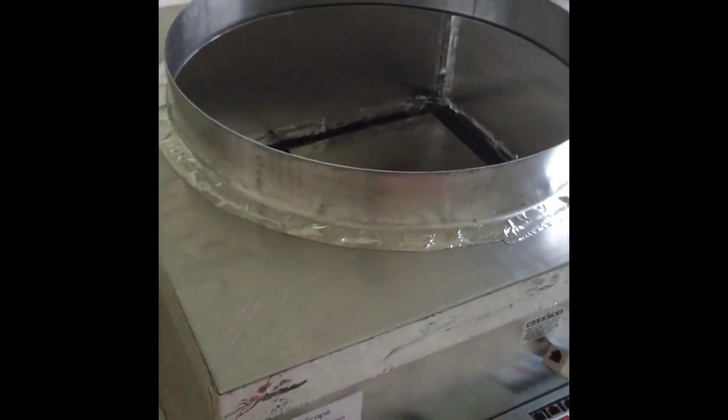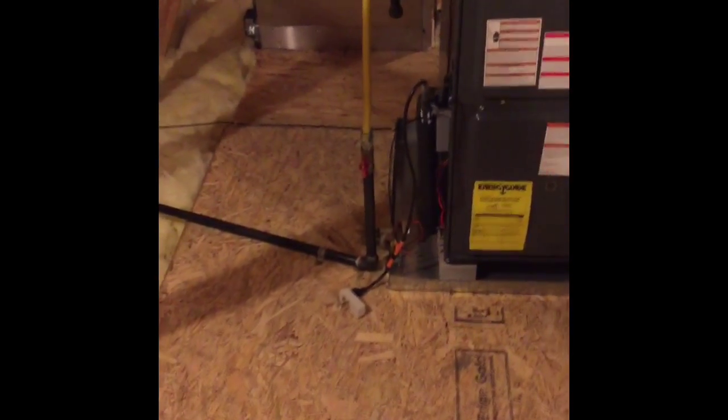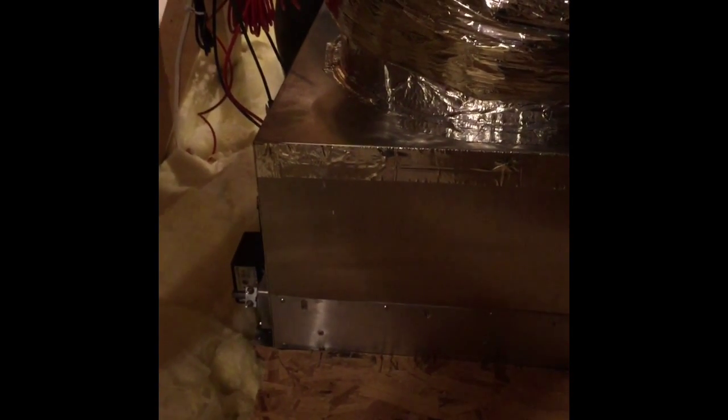Either way, the plenum box is built and it's time to cut a hole in the ceiling and find a place for it. I just finished the installation. How long it takes really depends on what you're installing into. I have a truss roof so my space was limited, and I also had a floor right over the center where I was going to install it, so I had to cut up a floorboard. Everything worked out well. The fan sits right on the joist of the truss. One thing to note: the trusses are made of 2x4s but the fan is supposed to sit on a 2x8, so I added 2x6s on top of the 2x4s, which gets me just over 2x8. As long as you caulk it up, it seems solid.